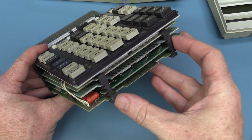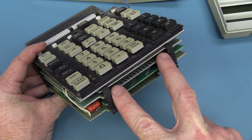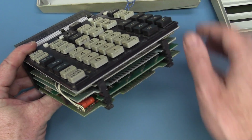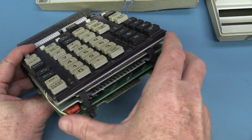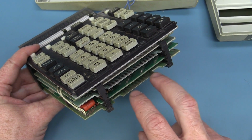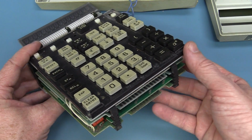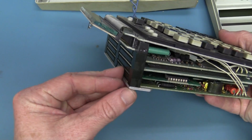Now what's interesting at first glance is, look, they've got the plug-in card edge connectors over here, and they're not actually connected up. There's nothing in the case or anything like that that joins them together. There's no bus on the end of it, or no backplane that joins these boards together over here. So that must be for production testing. I would presume that they can plug those boards into a test jig in the production factory and test them. That'd be my guess anyway.